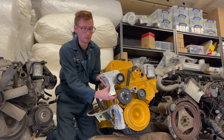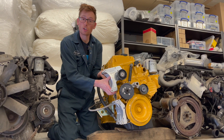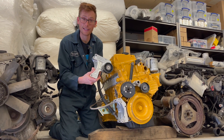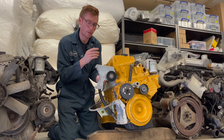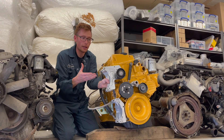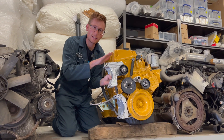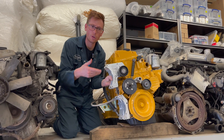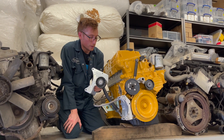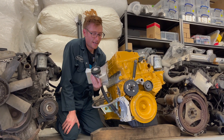If you've got a vehicle, there are other models out there that need this — it's absolutely fantastic. But something worth noting: if you are going to use a high-mount alternator bracket like this, you've got to consider your turbo choice. Because obviously if you're going to have a massive turbo on one of our billet manifolds or whatever, it's going to be too far forward and hit the alternator. So generally, this thing's designed for use with hybrid turbos and stock turbos, the same as any other alternator high-mount kit on the market. That's what it's for. Now, let's get into how to make it.